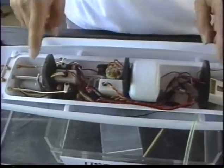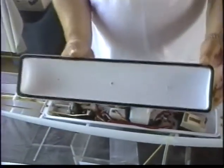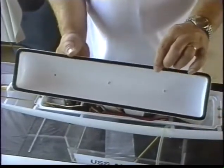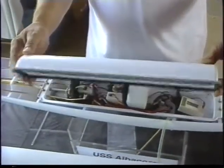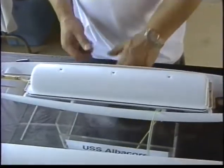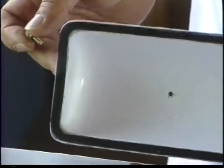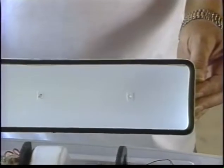The pressure hull itself comes with it — the bulkheads, these hold-down bulkheads. The pressure hull is sealed by this rubber gasket, soft rubber. It sits down like this, and then three thumb screws with O-rings go down through here. With this form — a cylinder cut in half on a longitudinal center line — it's an extremely efficient form for taking high external pressure. Pressure actually seals this better, and by locking this down it stiffens it immensely.